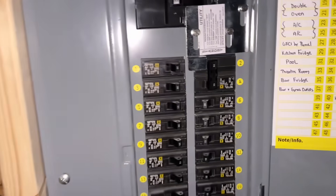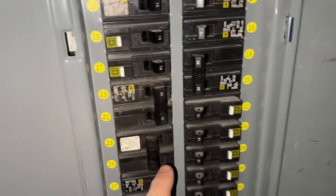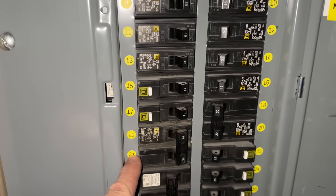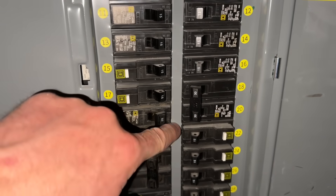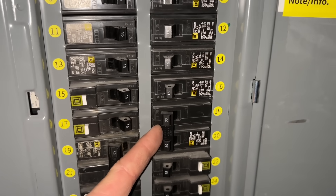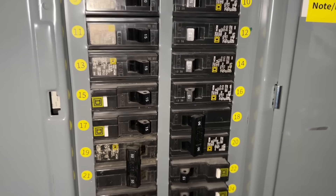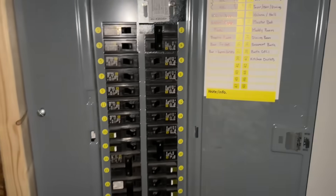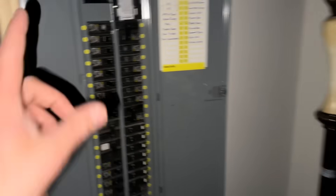Power is out in the house. Now I come down here — my AC is already turned off (breakers 23 and 25). I turn off breakers 19 and 21, which is my double wall oven. I come over here and turn off the double breaker for the dryer, and I'll also turn off the microwave breaker. Those are the things I'm shutting off.